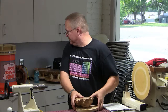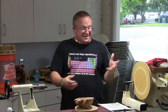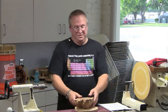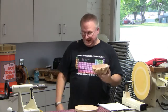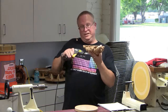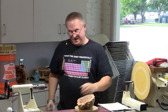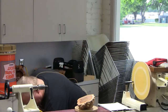As I discovered when I was doing one of these, that was small, my lathe has a 16-inch swing, so I made a couple of 16-inch backer boards and thought, I'm done. Well, you put one this size on a board this big, I can't get the glue gun under it. I can't swing the gun this way because the backer board is under there. So I realized, okay, I have to make several backer boards.